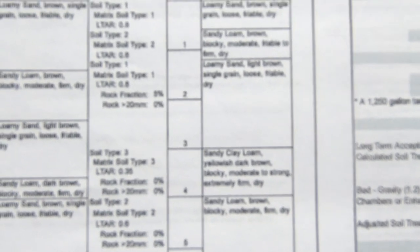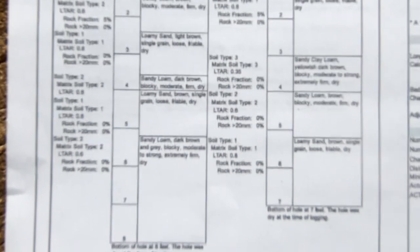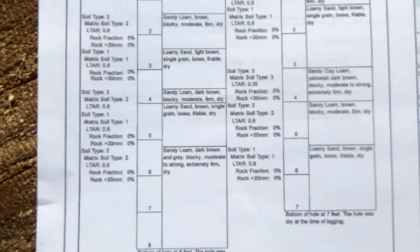That's really good because that's exactly what you need to make adobe brick. A few years ago we dug a test pit of our own here, about three feet down in the same general area, and the stuff we found had about 18% clay. The engineer who looked at this actually squeezed some out with water, did some field testing with it, and thinks that it's really good soil for adobe brick. That's good to know. I'll jump down into that test pit and verify it.